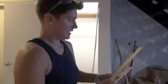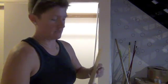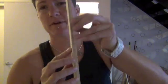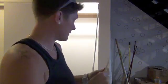Shims. Some people like to install this leg right against the framing. I like to have it out a little bit so I can kind of manipulate it a little bit. Shims go together like this, and you can create a deeper space or more shallow space. So I'm actually going to tack above this so that I can pull the nail out and adjust it. I mean, but this is more or less, you want to be able to manipulate this at this point.